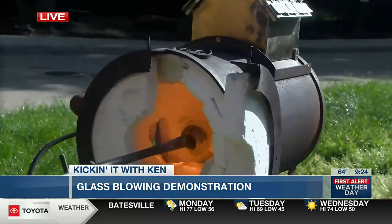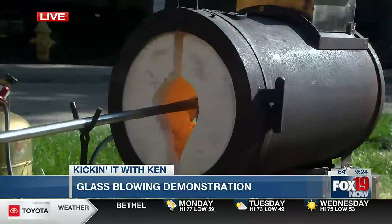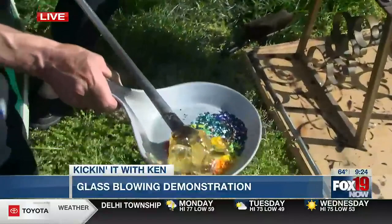So at what point are you actually going to start blowing to elongate this thing? Well, the first thing we need to do is put a little bit of color in it. The way that we're going to do that is — I purchase glass chips, and I've got a pan of these glass chips down here. We're going to get the liquid glass hot enough that we can just dip it in this rainbow pan, and that's how it gets the kind of stripings on it. Exactamundo — very cool.